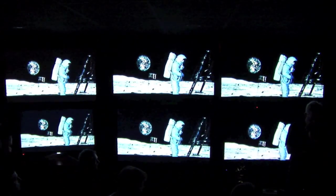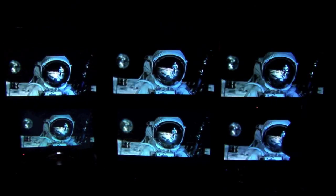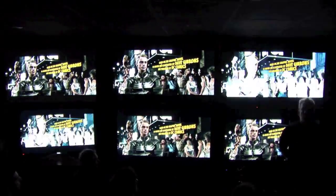Last year for our ANSI checkerboard pattern, we used a 4x4 matrix. This year, we used a 5x5. So with a local dimming zoned LCD, with the 5x5, you got more of a bleed between the whites and the zones. You have more white boxes. Now, some people may say that invalidates the actual contrast ratio for ANSI. Yes and no. Remember, with regular content, you're going to get zone bleed.